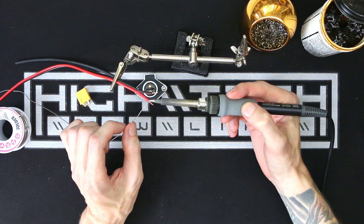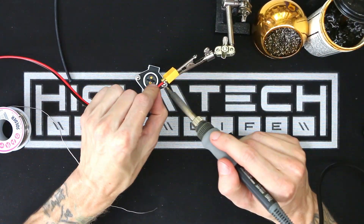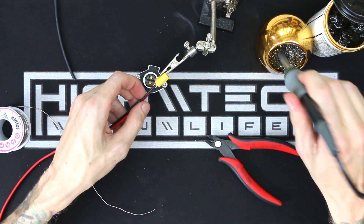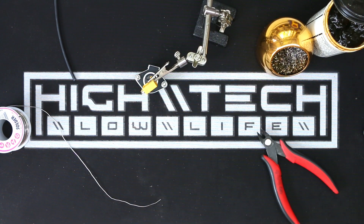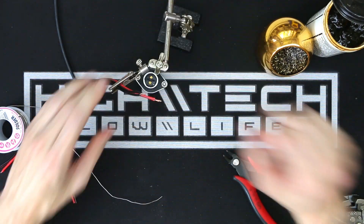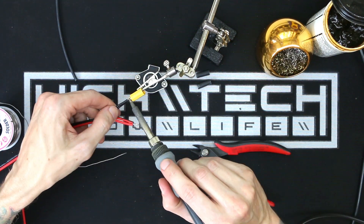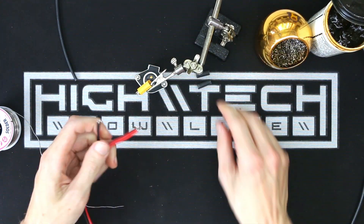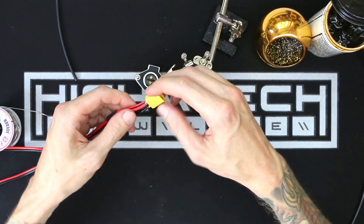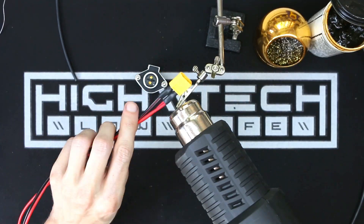Now it's time to wire up the charge port and the buck converter. The voltage on the battery pack is 72 volts and you do not want to be feeding that into your accessories like your lighting. The buck converter — also known as a step down converter or a DC to DC converter — will take that 72 volts and drop it down to 12 volts. I'm going to be installing a lot of connectors in-line in this part of the wiring so I can remove the components individually without having to desolder anything. Some battery packs only come with two leads from the factory, and I will always add two more leads so that I can charge the battery pack without having to disconnect and reconnect it every time.